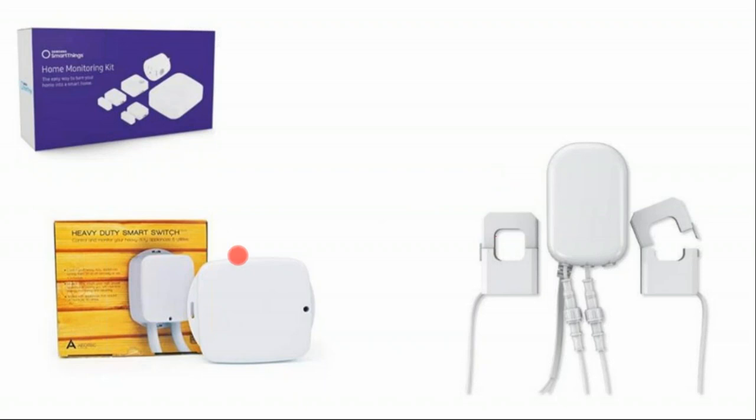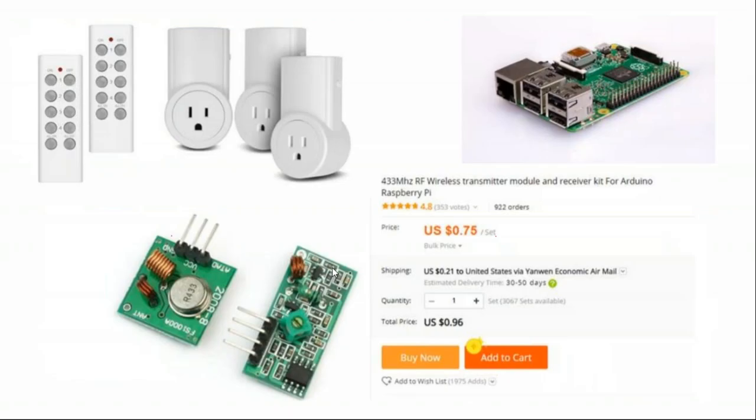So this is a 40 amp switch that can be used to control an electric tank water heater. And so I have a smart home where we have two electric tank water heaters, and we have them both on these smart switches, and it makes sure that both tanks don't come on at the same time, and it also makes sure that the tanks don't run, say, when the air conditioner is running. So they're very effective and very cost-effective products. They're basically what an electrician would think of as a relay with a wireless trigger rather than a hardwired trigger. So they cost about twice as much as a standard relay, but they come with packaging and wireless antennas that make it easy.